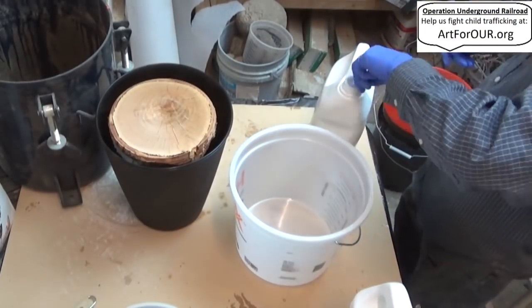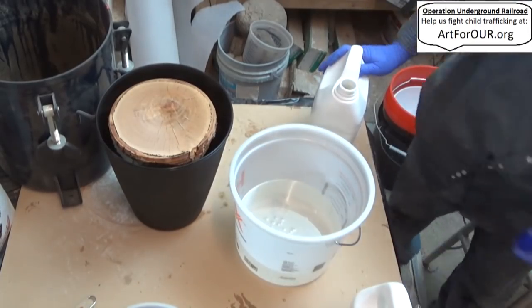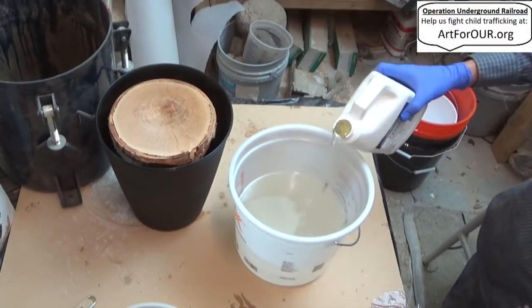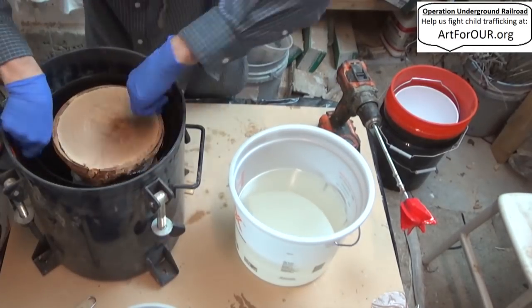It allows up to about 3 inches of thickness in a pour. They say 2, but you can get away with 3 if your temperatures are on the cooler side, and you've got wood within the resin, so it's not just straight 3 inches, but you could get away with that, and it's worked out wonderfully well.